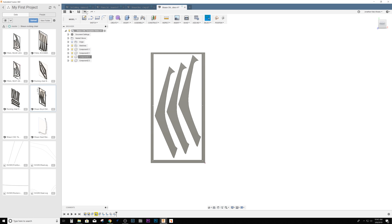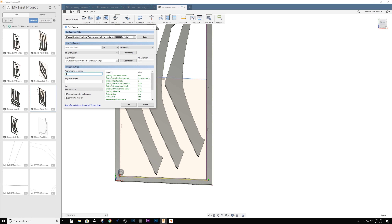I'm going to walk you through the process. To get started, we're going to import our template — or of course you can draw it in Fusion yourself. We're importing the rear leg, which is one of the pieces that's way too big for the CNC, so Sean was cutting it by hand. Now that we've imported our SVG, we're going to draw out our stock — the size of the MDF board we're going to use. This is a way to create stock in Fusion that is the exact same piece as your board, which also allows easy ways to place parts.